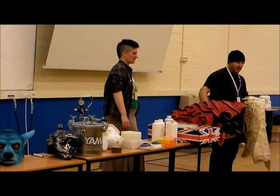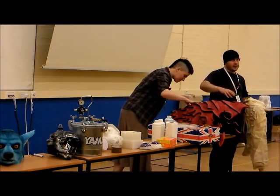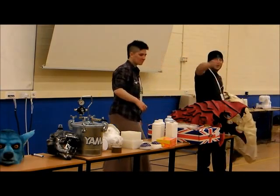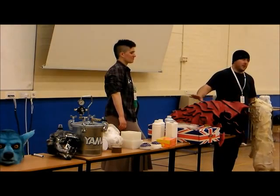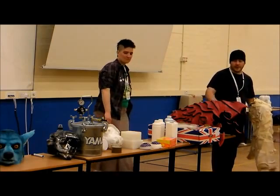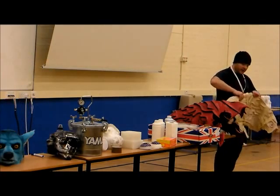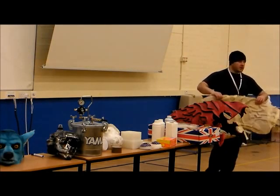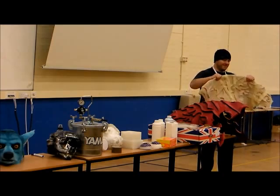Painted latex all over, and then what I've done is I've got car cleaning cloths that you can buy from Wilko's. They're like miles long, you get tons of them, they're a couple of quid, and you just layer them on, similar to how you do fiberglass, if anyone's done fiberglassing, but you do it in nice big sheets. What you get then is still floppy, but quite rigid and quite solid, and it doesn't want to stretch, because it's got that reinforcement.